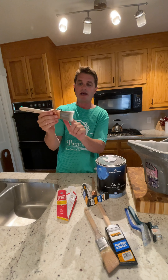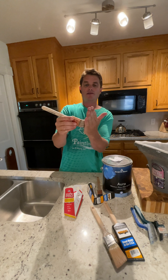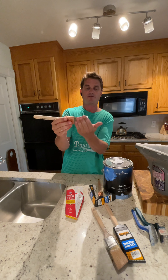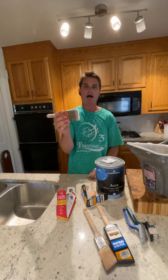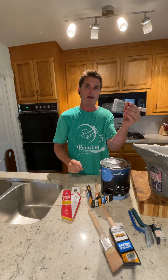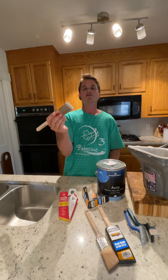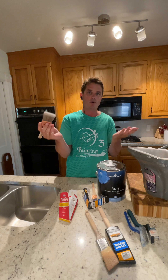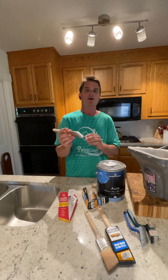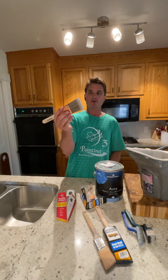When the bristles wear down, you're not able to flex or lay down the paint properly. The shorter the bristles, the less flex in the brush. When you go to lay off or feather in the paint, you're actually going to be taking away the paint because the brush can't flex down to leave it there. Essentially, when the brush gets worn down it turns into a blade — it takes away the paint instead of laying it down, so you won't get the coverage you once did.